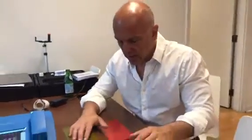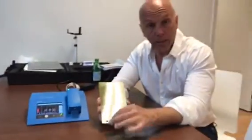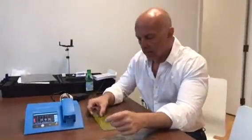The problem is trying to measure any of these things other than based on how many times you've run it through the etcher. For instance, if you were using a one-step plate — a single step, no line screen photopolymer — it etches exactly to 30 microns. Or if you're using a laser plate, you'd know the depth because it etched off the laminate. But mostly, these are measured with a depth measuring microscope.